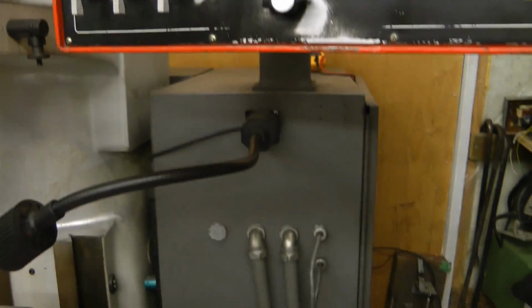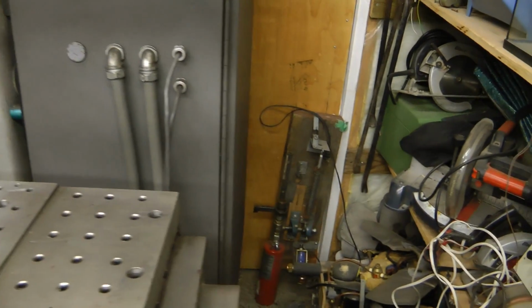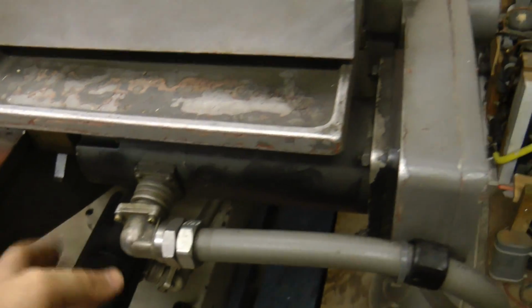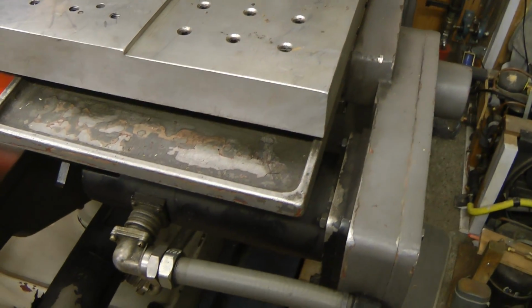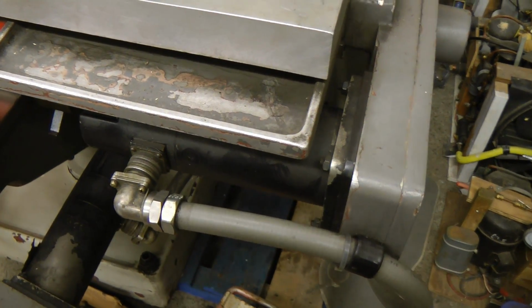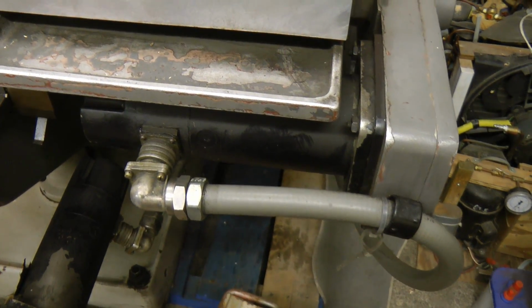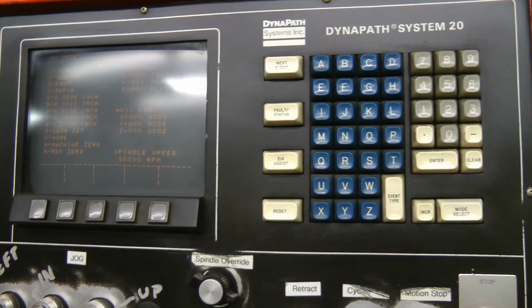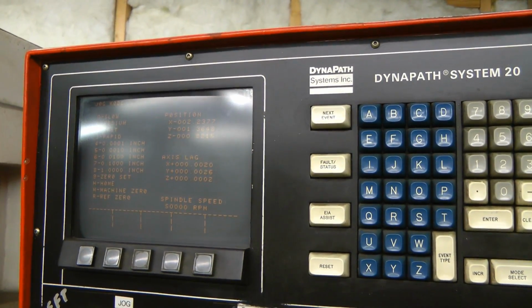Basically I believe the servo drives in this operate in velocity mode. So the main controller unit in there sends it a command for velocity, and the controller looks at the tachometer output from the servos and adjusts the current to try to get the velocity as desired. And there's a little balance pot that adjusts the offset of that. So if that's off, it has to drive a non-zero voltage into the velocity command in order to get zero velocity. And what I think the control is looking for is the velocity command to be zero to determine that it is in the desired location.